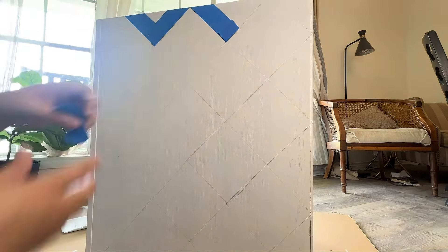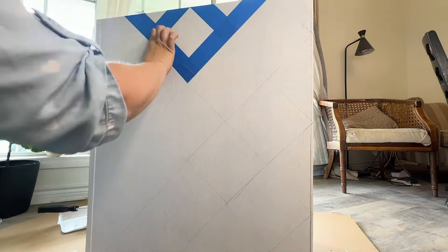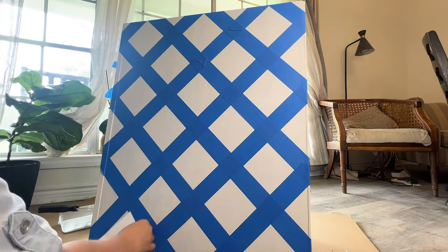I would recommend doing this differently — on the other side I did it much smarter. On this side I cut individual pieces, but I started making longer strips and those are much easier. After getting all my pieces on, making sure they were straight and flat, I went through and erased any pencil marks that were a little off. A key tip: use a sealant whenever you're painting over painter's tape — this helps the paint not seep under the tape and creates really beautiful crisp lines.